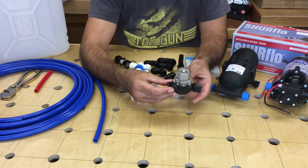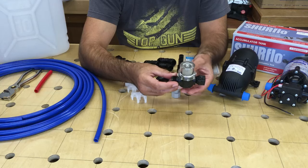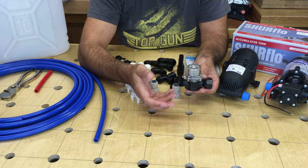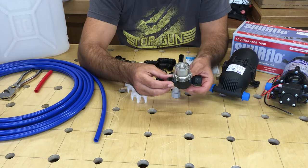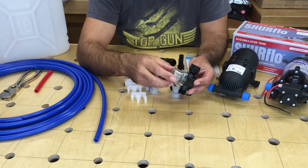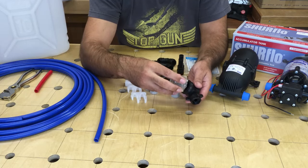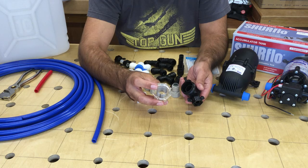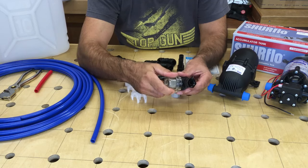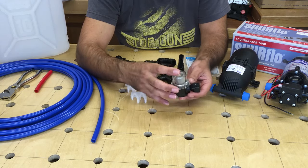On the inlet to the pump we're going to install this little inline filter. It will be connected between the tank supply and the inlet of the pump. If there's any debris, sand, or bits and pieces in the water supply, this will make sure nothing larger goes into the pump or damages the system. You simply unscrew the top and there's a little wire gauze inside which you can take out, wash occasionally, and put back. It's a simple cheap means of protecting the rest of your system.